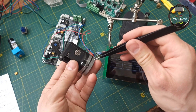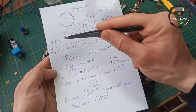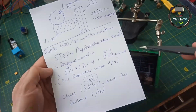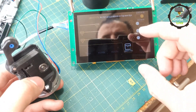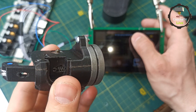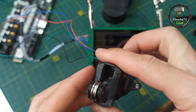The assembly is complete and everything is tightened. Before we begin testing, let's go over the calculations again. Last time we tested with a 1:20 gear ratio on the metal version; now on this plastic version we have a 1:5 ratio. So instead of 20, we put 5: 5 × 12 × 4 = 240 steps. We set 240 steps on the screen. We move to the movement menu, select 100 mm — watch how fast the gear spins, very fast for a stepper motor. Thanks to the correct 1:5 gear ratio, the motor runs without any jamming or problems.